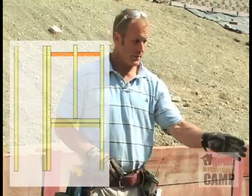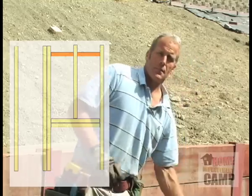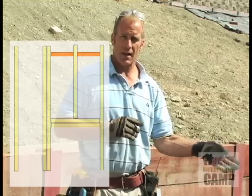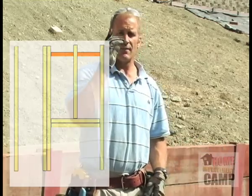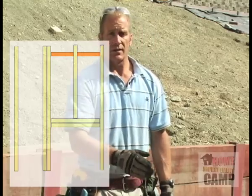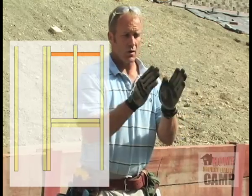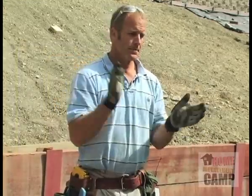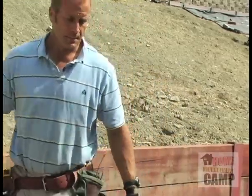We'll go down here and we'll cut a block for our joist, because since we doubled this up, it's going to be a special block in between this joist we just put in and the doubler. Also, we're going to have a special block between the one we just put in and the rim joist. Because that shortens up, because that's where we started layout. We talked about that earlier. So, I'll measure for those blocks, cut them, and then we'll put on our rim joist.